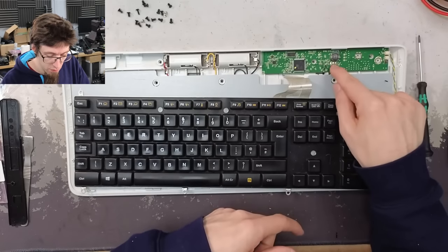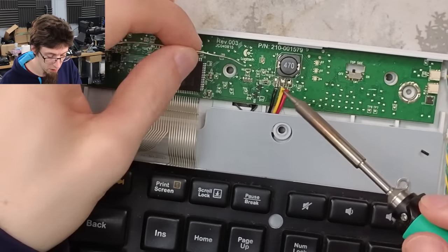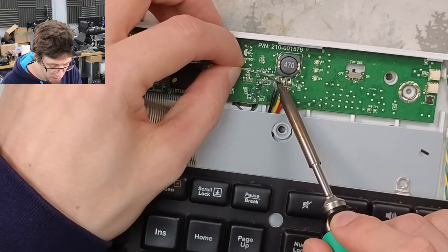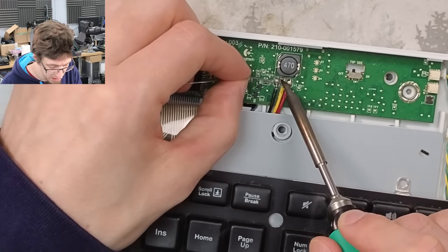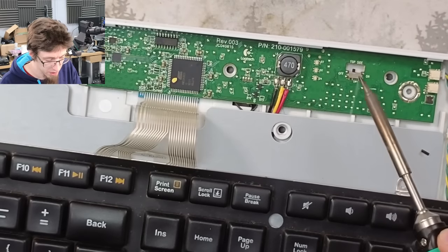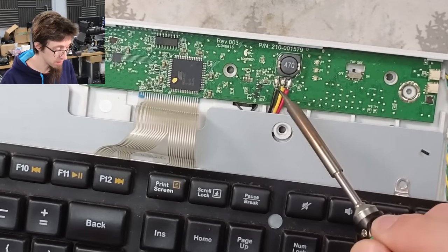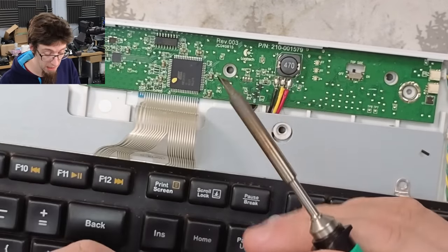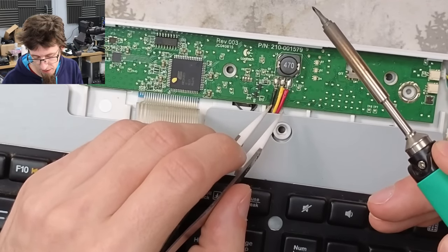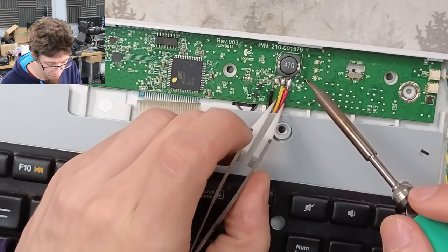This needs to come out but I've got to remove those cables first, so let's fire up the soldering iron. To remove these wires I'm just going to flow a little bit of fresh solder onto each one — this is called wetting the joint. Flowing fresh solder on makes it easier to get it to move again, and because I'm using leaded solder here, the leaded solder mixing with the unleaded solder lowers the melting point of the join. My soldering iron was on the low side so I've gone to 370°C — those wires are just popping right off now.